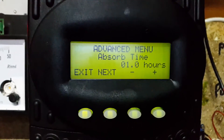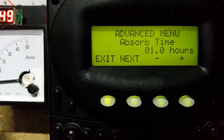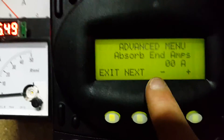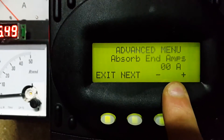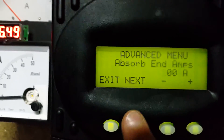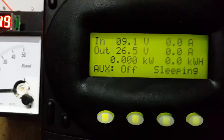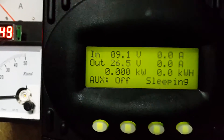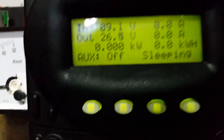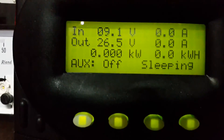From 3.45 to 3.6 volts charging you're not getting very much extra energy at all, and hopefully getting them all equalized and balanced properly.